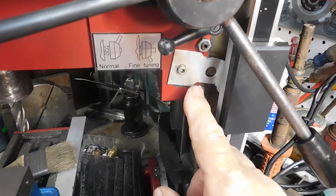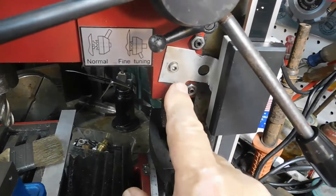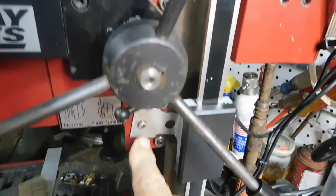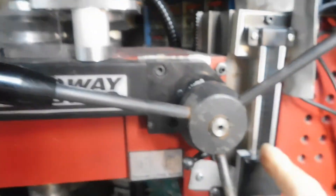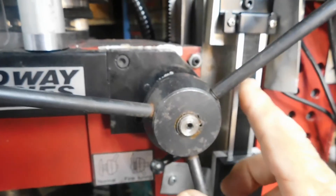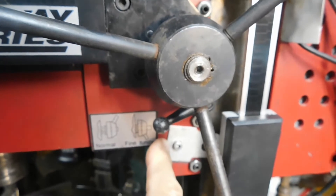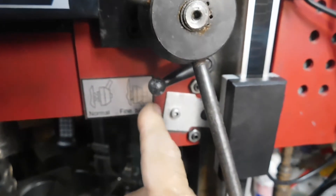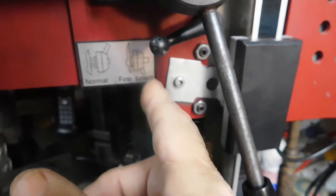When you get this bracket made, install it to the sliding device but not to the mill. When you get your bracket installed, run this all the way up to the top. This is snug at the top; the bottom is relatively loose. You get it up there — now this is holding the bracket where the end should be. You mark a line where the bracket's at. Remember, the bracket's not screwed down now.